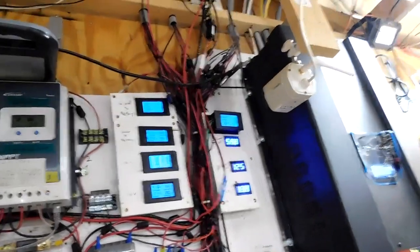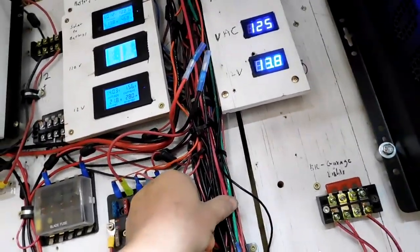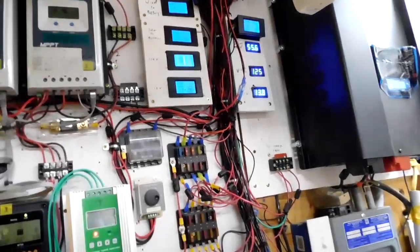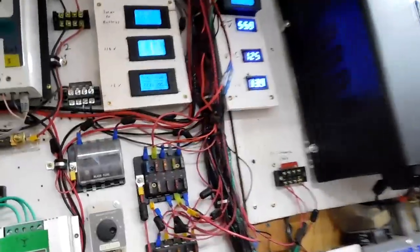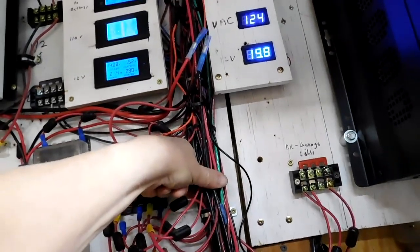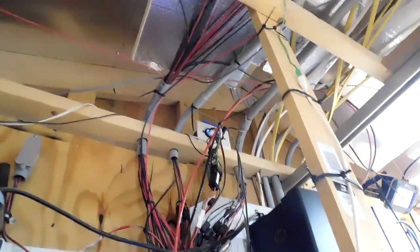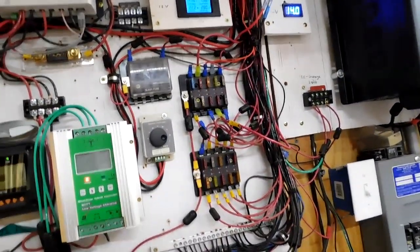And what I could do theoretically, see, most of that is to charge chargers, 12 volt chargers in the house, and cigarette lighter plugs, because the house was originally designed to be a 12 volt house. Everything was supposed to be 12 volt. But unfortunately, you can't get a lot of good 12 volt stuff like microwaves, ceiling fans, and all that other stuff. So we ended up going with 110. But what I could do is replace all of those chargers out there, or most of them, because we only use like 2 of them ever. We could replace them, and then I could cut some of this out. I could replace them with 110 volt plugs, because they're in the same outlet. I don't have one in here to show you, but like that one up there is for cameras, and it wouldn't be too hard to convert them over to 110 and just use wall warts.